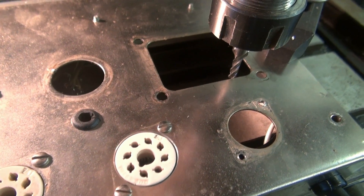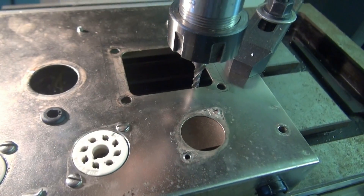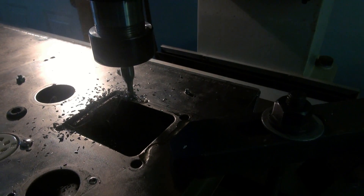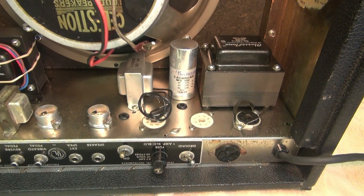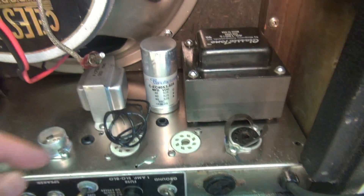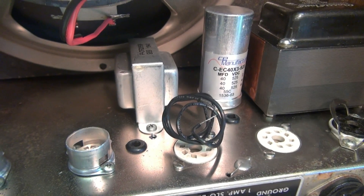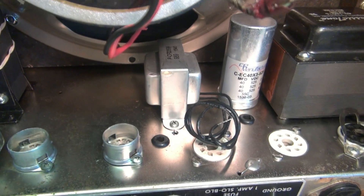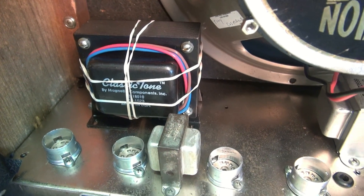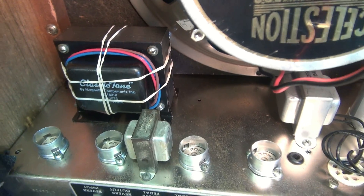Here we are on the mill. We've got the pattern laid out — transformers, tubes, all that are out of the way. Let's make a hole. Making some progress. Power transformer is milled and installed. There's the filter cap; it's going to clear the speaker nicely. New choke — that's actually in the position of the old original output transformer, and it actually lined right up with the holes; I didn't even have to drill. And over here is the monster output transformer. We're going to get that in position next, get it bolted down, and the wiring process will begin.